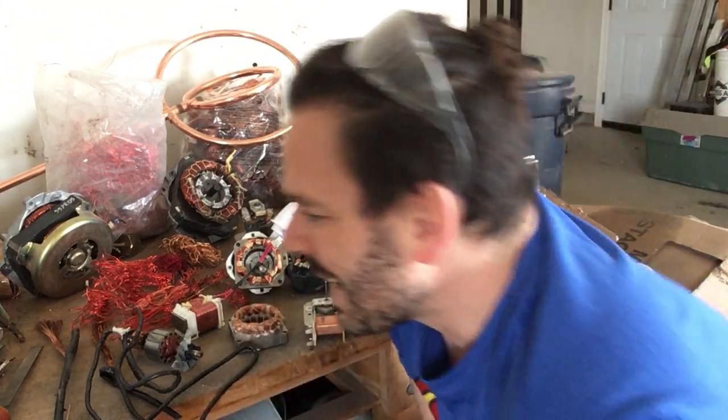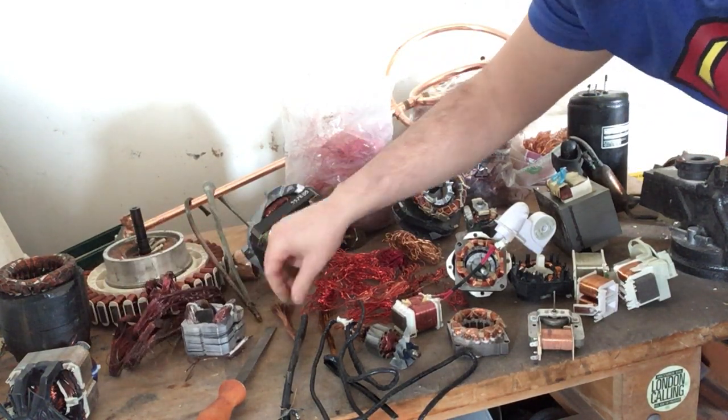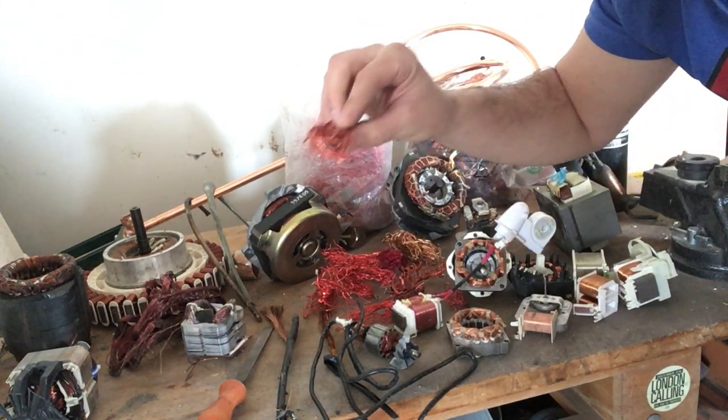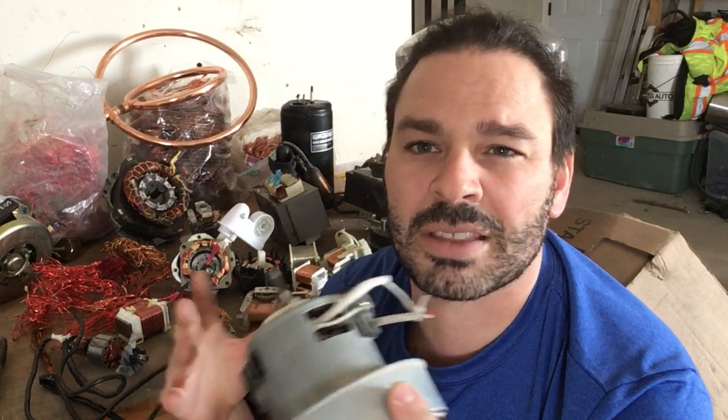A couple of very important places that we look are copper bearing motors. As you can see, there are different colors — we've got some that are a dark maroon look, some that are a nice clean bare bright look, and some that are red coated. One subscriber made a good point: they actually don't take apart vacuum motors and other motors because they think they are mostly aluminum. And given the time right now, there has been a lot of changeover from copper to aluminum coil. A lot of manufacturers now will use aluminum because it's cheaper and just as conductive, and it is made to look like copper with a coating on it.